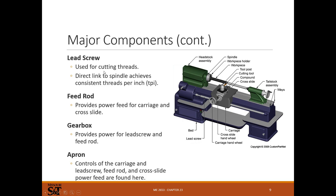The lead screw - that's the thing I couldn't think of the name of before - will be connected through some gear ratio to the motor turning the spindle. The ratio will be adjustable, so you can change how fast your X and Z will move when set to move automatically. It'll also change your thread pitch if you're doing threading. Some machines have a separate lead screw and feed rod; on other machines everything's done by the lead screw.